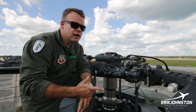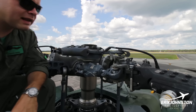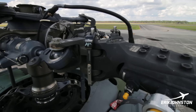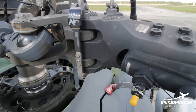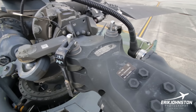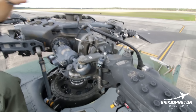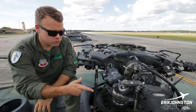We have this pin system that allows us to either completely remove the blades or fold them back for air transportability — they can sling all the blades back over the tail to decrease the footprint of the aircraft. These wires here are for the blade de-ice system: just like the tail rotor, the main blades have bonded electrically-heated surfaces that can shed ice.